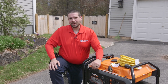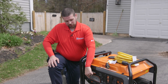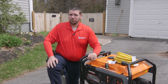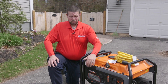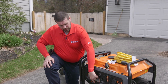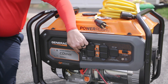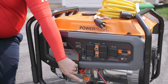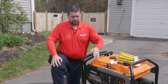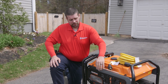So we're working with our Generac generator. We've got a GP8000E. The GP stands for gas-powered. 8000 stands for the amount of watts that this has. It's important to select the right size generator for your home. The E stands for E-Start. This is a pretty handy feature — we have the switch here and the connected battery. This helps your generator start right up by a push of a button. Most generators are equipped with a rip cord on the side, and this helps avoid that.